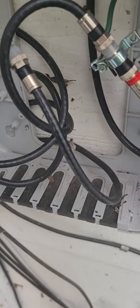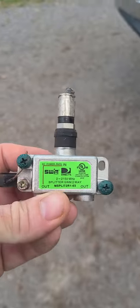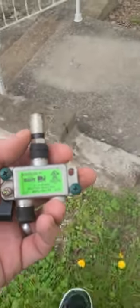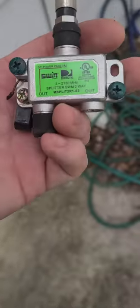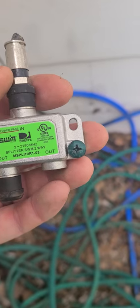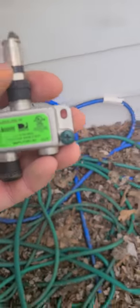The only way it's not going to work is if you're on a satellite dish splitter. These are the dish splitters. If you're on one of these things, it will not work. So if you have a dish and you're also getting Comcast, Cox, Charter, or anything like that for your internet, it's very possible, but these splitters — whether it's DirecTV, AT&T, Dish Network, or whatever it is in your area — will look different from each other. Normal cable providers will not work through a dish splitter.